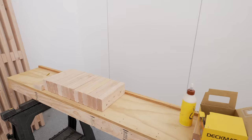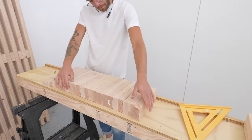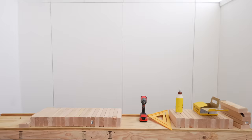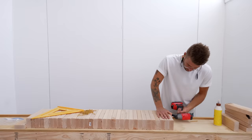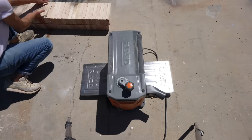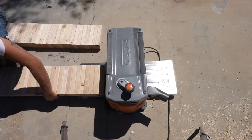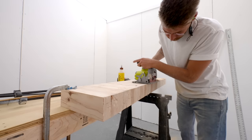I did my best to mix up the grain of these boards so I didn't have two pieces from the same 2x4 next to each other. I'm going to have links to all of the materials and supplies in the description, along with links to free plans if you want to build something similar. I let those glue-ups cure for about an hour, then ran over to my buddy Ben Ueda's place to borrow his thickness planer and save a lot of time on belt sanding. Then I used a circular saw to trim my pieces to their final height — 9 inches.